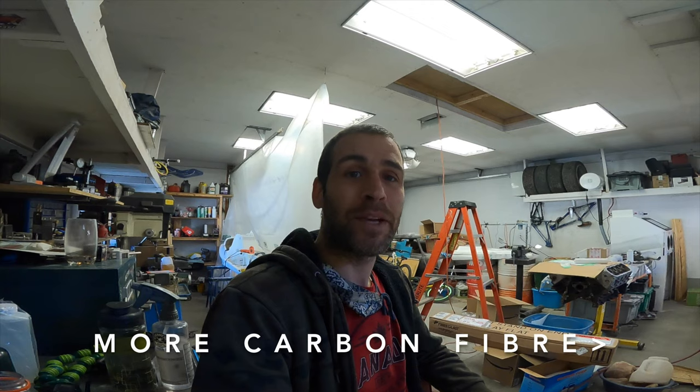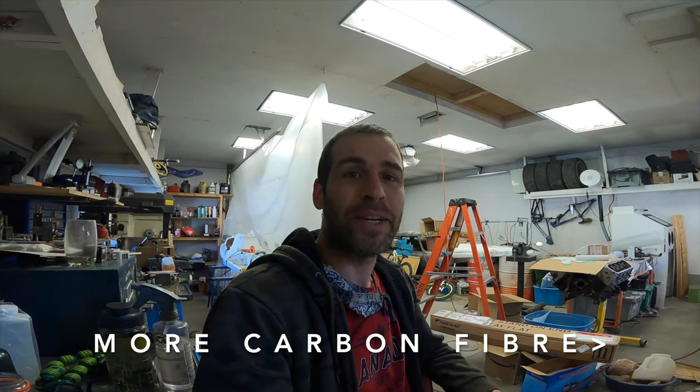As you guys can see, that pump looks pretty disgusting on the inside, so what I'm gonna do is package it up and send it back. Even if your pump isn't so rusty on the inside that it's seized up, any little surface rust or contamination inside of the pump is going to cause premature wear, because what's gonna happen is that rust is gonna mix in with the oil. That's then gonna get pumped all throughout the pump, and yeah, it's just gonna wear out the surfaces. It's going to lead to either a lowered vacuum or just a complete pump failure.